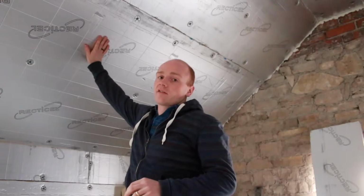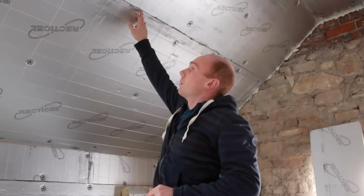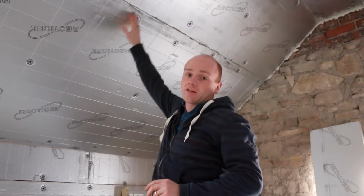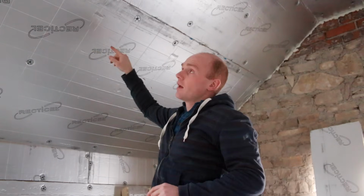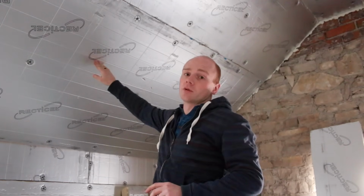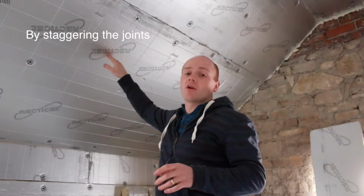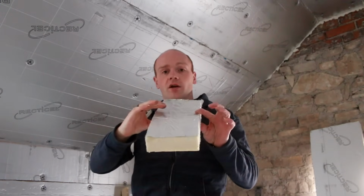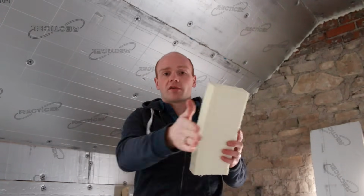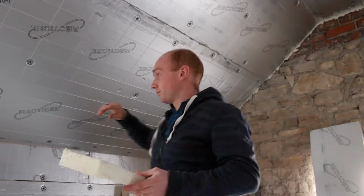So when you've got the foil face like this, that acts as our vapour barrier, but you've got the joins in between the boards. Now we're going to tape that with the foil tape, which makes it continuous. The nice thing about using this stuff rather than insulated plasterboard is that the joins between each sheet of plasterboard or drywall don't carry on through the first layer of insulation. I.e., if we've got 50mm of insulation bonded to plasterboard, every time there's a join, that join goes right through to where the rafter is, so where a cold rafter might be.